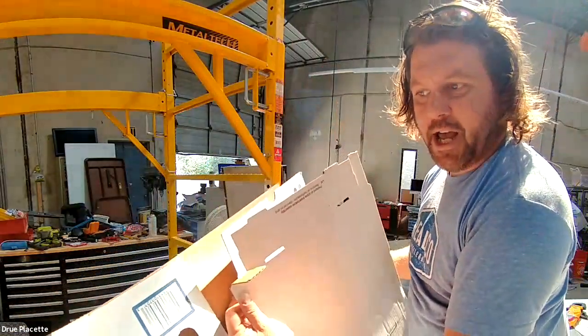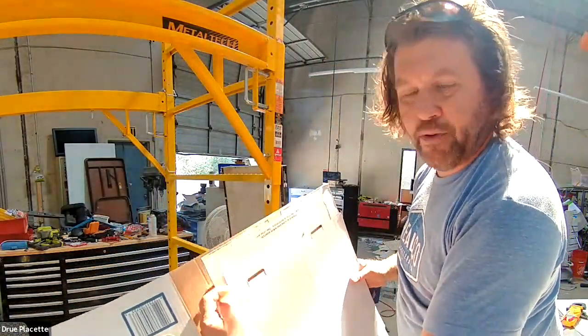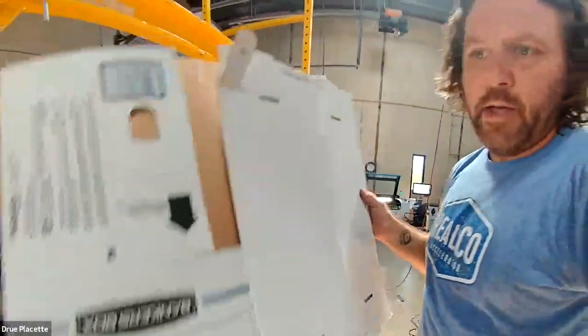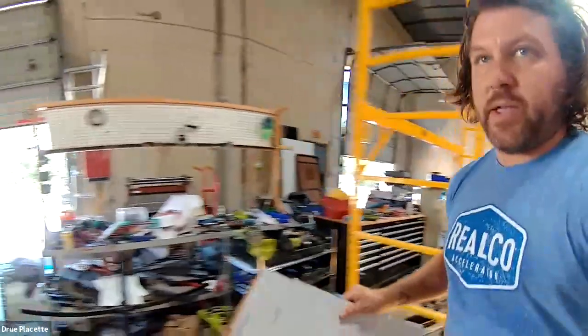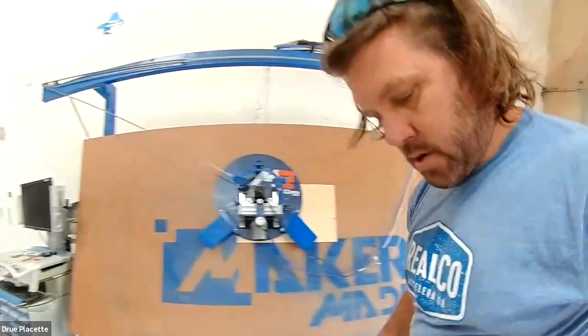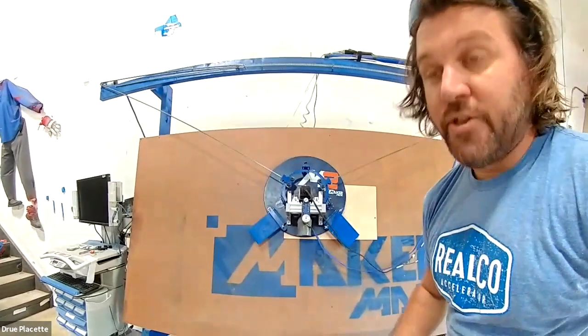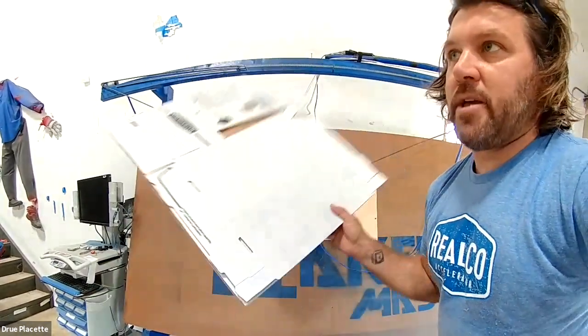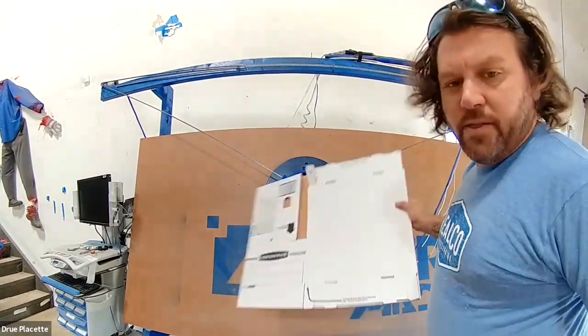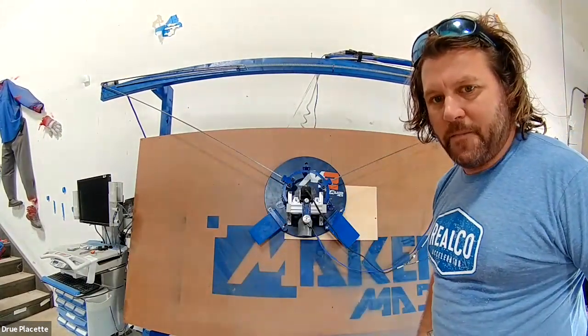You just do a dashed line there, and that creates a perfect fold. And then you can also do the cut. The laser's way better for that than drag knives. Basically, you're doing your own perforated line. Yeah, and I do that a lot because there are things I need to make special. That's why I save all my cardboard, and the JTech laser module is beautiful for that.